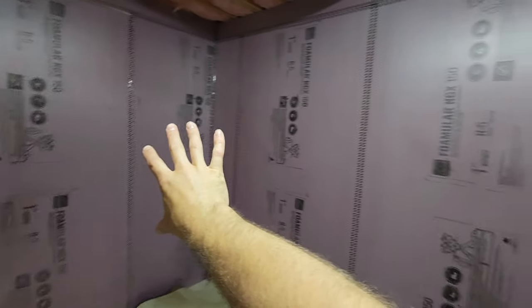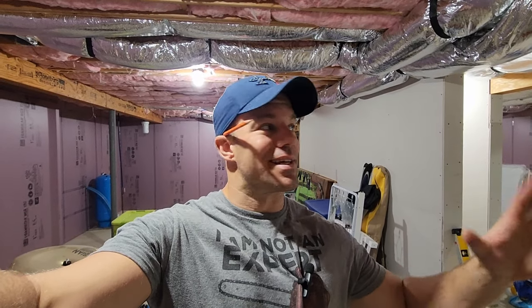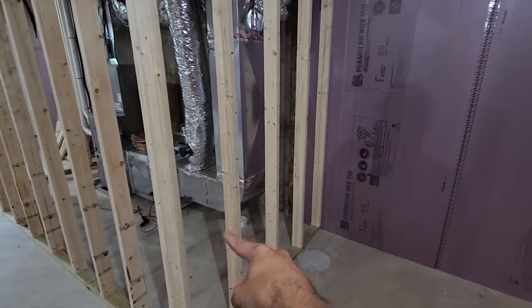This wall should be pretty quick — just measure the distance between the marks, cut the boards, bolt them down, then build the uprights. When working with a 12-foot two-by-four by yourself, use a ladder and some blocks of wood as a helping hand, especially when cutting — if it's not level it'll tip up and your cut won't be flush. Mark 16-inch on center on both plates, then use a speed square to transpose the marks to the second board so you only measure once.